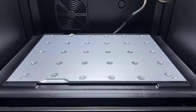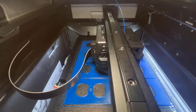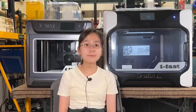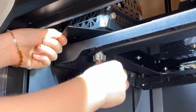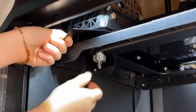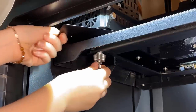Six, the thick solid aluminum print bed is super flat. I don't have professional equipment to measure how flat it is, but when I print something that occupied the entire print bed every single part had a perfect first layer — which is why you can't see any BLTouch or similar ABL sensors on this machine, as auto bed leveling is no longer required. Seven, the bed leveling spring mechanism is excellent. I believe they already leveled the bed in the factory, and after a long shipping distance when I checked the level of the bed it is still almost perfect. It uses a double screw which fixed the print bed really well.